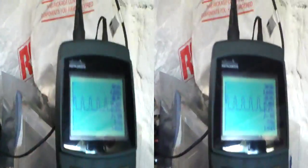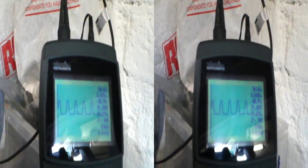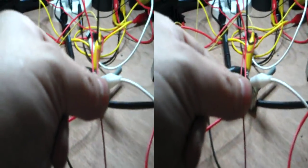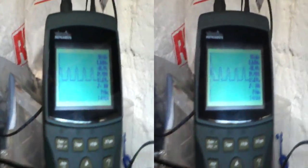What that means is that the voltage is peaking above the battery voltage. I have got a diode in this here — a power diode in line, as you can see. So there's the negative through to a diode, which then goes through to our charger, which is just jointed. The capacitor isn't in the circuit, but it's just using that where the terminals were. That's the negative through a diode, pointing the right way, and then the positive goes to the positive circuit. And this is the scope, so you can see what's actually going on.